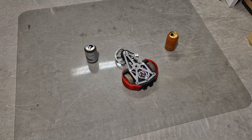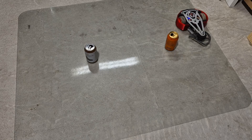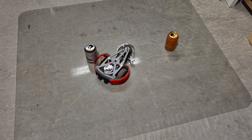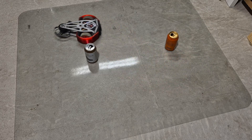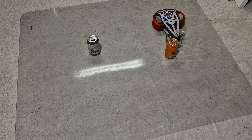As you could see, it is quite powerful and it spins up fast. Unfortunately, the forks in the back were way too weak and got completely destroyed. Instead of trying to make them more robust, I decided to get rid of them altogether and replace them with more TPU armor.